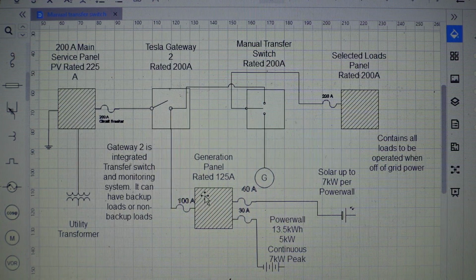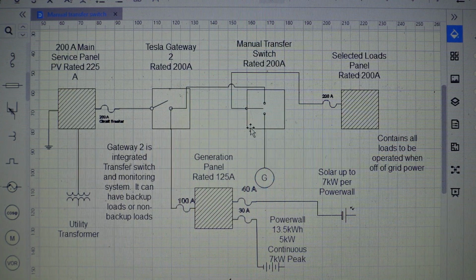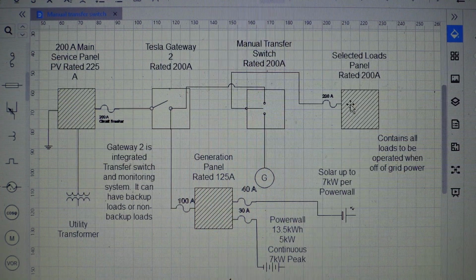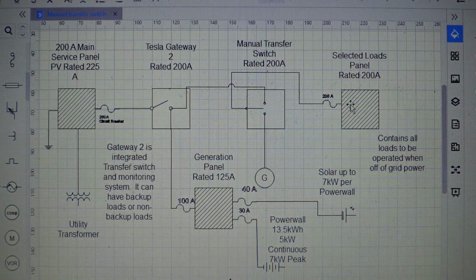The generation panel is different because it is not getting grid power with loads in it that are running. It does have loads because the Powerwall will be charging, but it is not subject to that rule. So anything else would need to be rated sufficiently. So we would technically have to move this breaker down to 225 or derate this breaker down to 175 or 150 depending on your load calculation. So just to clarify, to make it work with the transfer switch, it has to be isolated away from any solar, just to feed the selected loads panel so that you don't have any issues with blowing up your inverter or potentially a generator. Alright, thanks for watching.